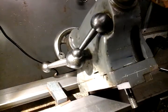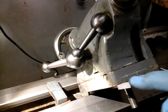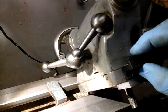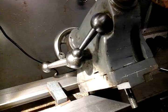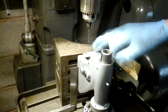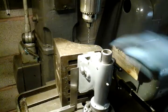I've repositioned the tailstock to show you - I'm going to put two holes in the tailstock base. It won't interfere with any workings of the tailstock, I've made sure of that, and it's not going to go too close to the T-slide. I thought I'd show you - I've clamped my tailstock to an angle plate and set it up with a square so it's vertical with the drill. I'm just going to drill two holes to take those 3 BA screws.